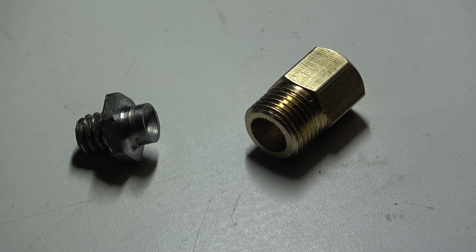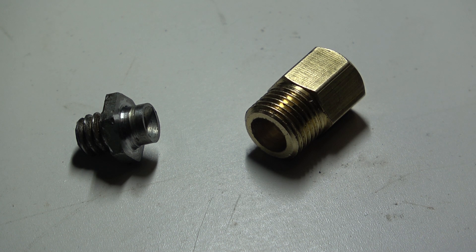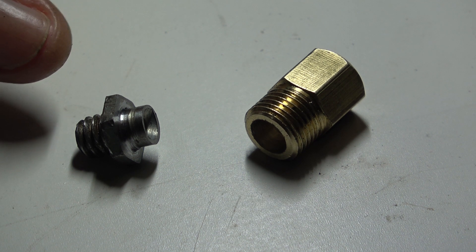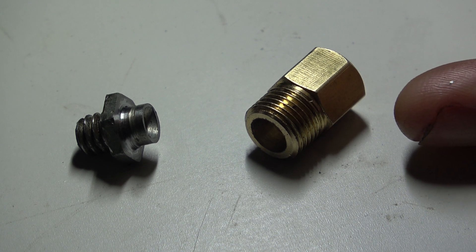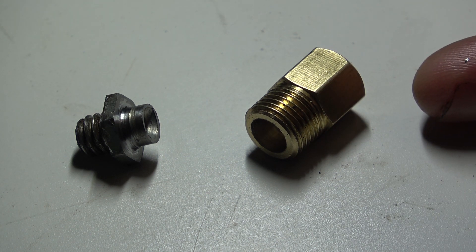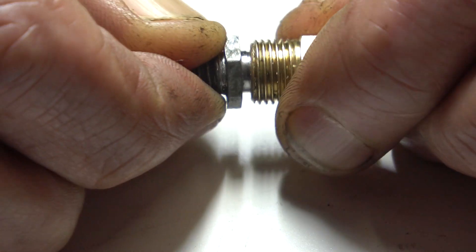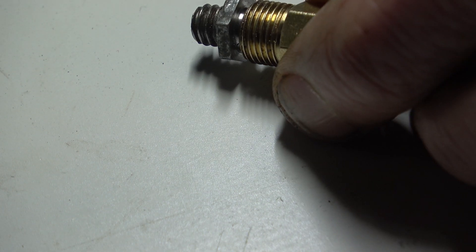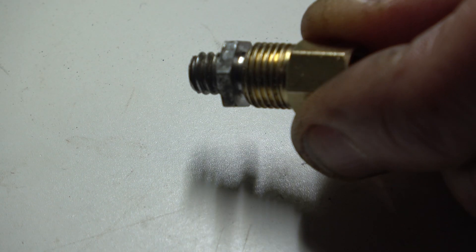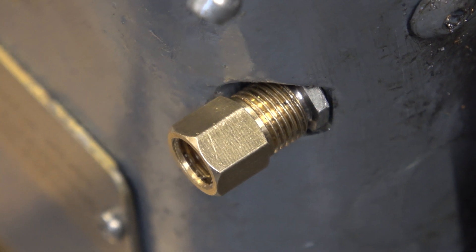I'm just prototyping at the moment, being careful because I don't have any spares. What I've done is taken the angled grease nipple with the quarter Whitworth thread and machined a six millimetre peg on it, then drilled and reamed a six millimetre hole in the end of this brass union. Let's look at how they go together — I'll try to keep it on camera; it's very difficult with the zoom. I could press that in if I wanted, so I need to refine this design a bit. But that might be the idea.